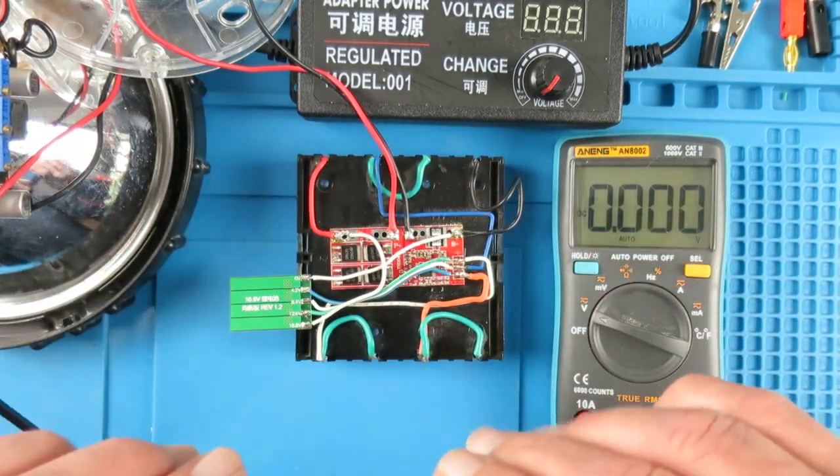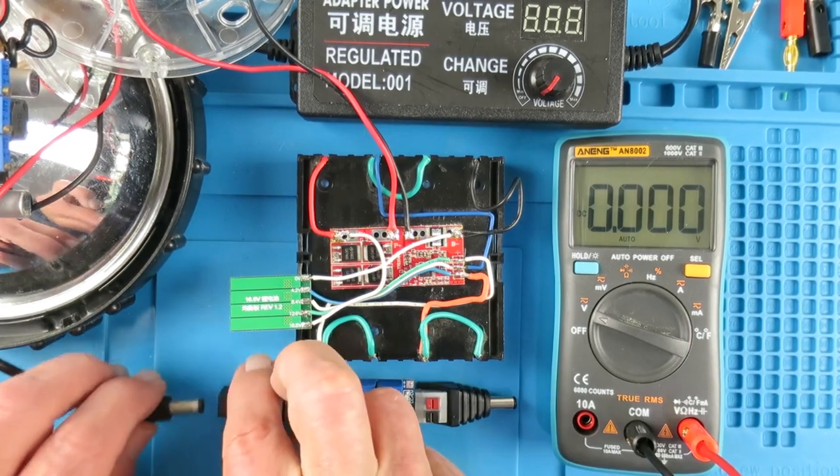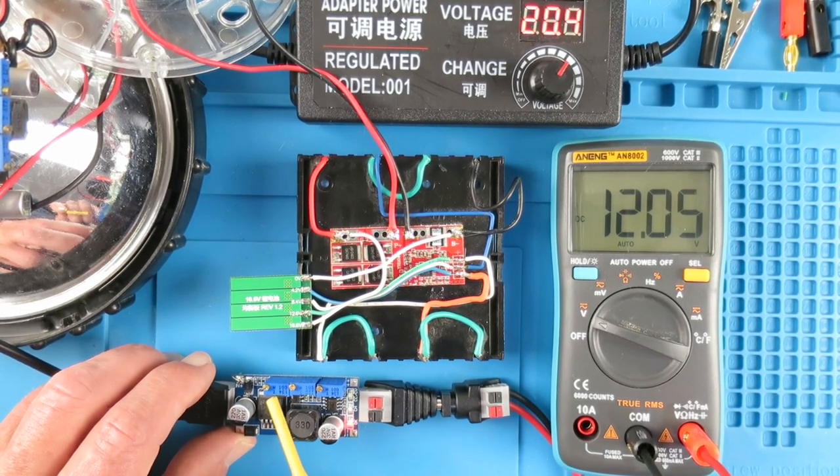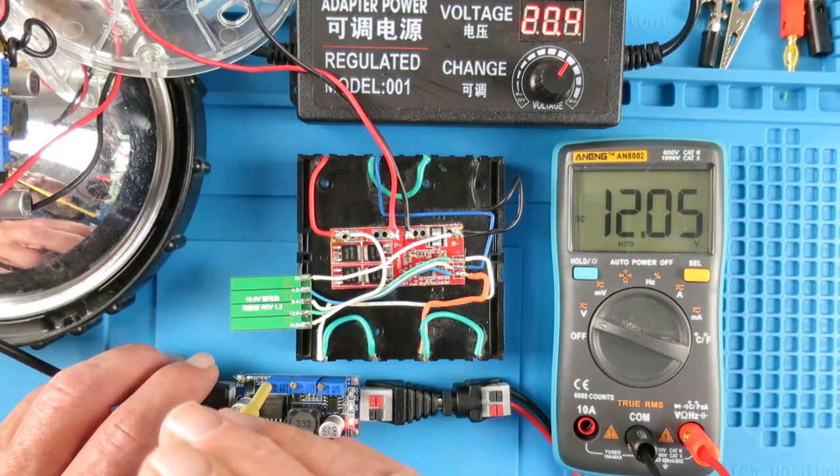I've put sockets on so I can use the same connections. First thing is to quickly set that up — it's giving us 12 volts at the moment. The three potentiometers on here: you can disregard the middle one. This one controls the voltage and this one controls the constant current. There are LEDs that indicate the various stages — just got an OK light on there at the moment. I do have a video where I've used this both as a battery charger for a lead-acid cell and as a constant current source for an LED driver — links are in the description. Now let's get the voltage sorted.